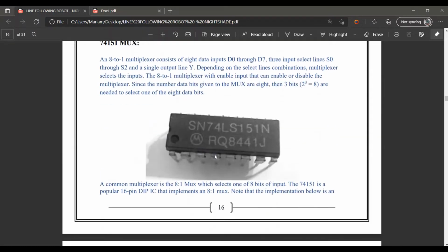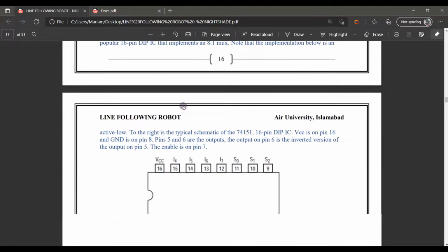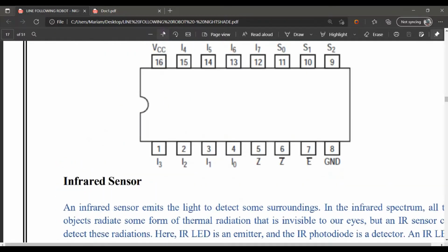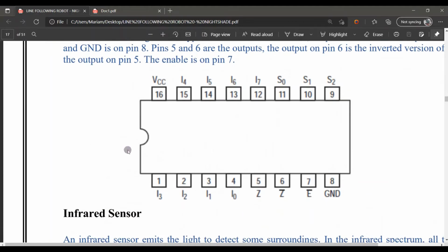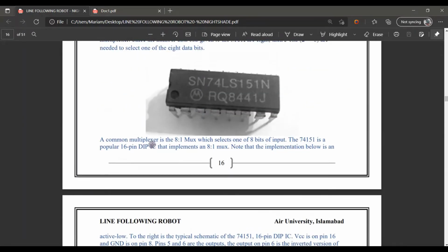This is a mux. As a simple multiplexer, we have to provide 8 inputs and 3 selection lines which control the inputs to get a single output. Furthermore, these are the input configuration of our muxes which a hardware mux has.